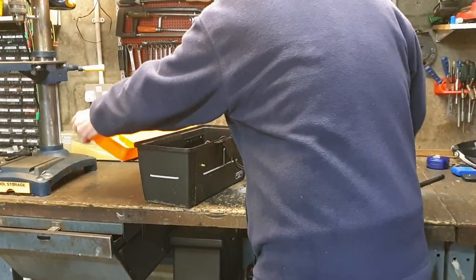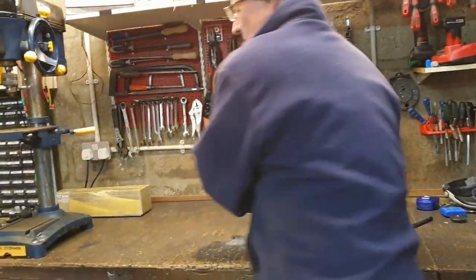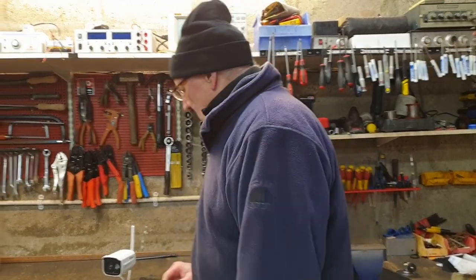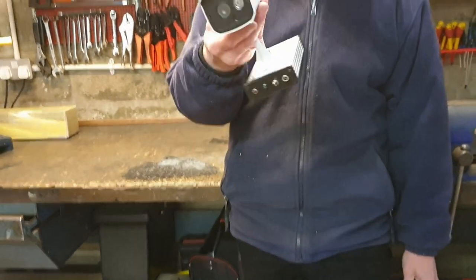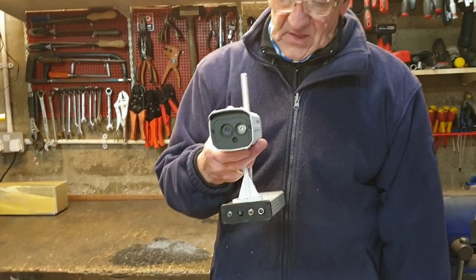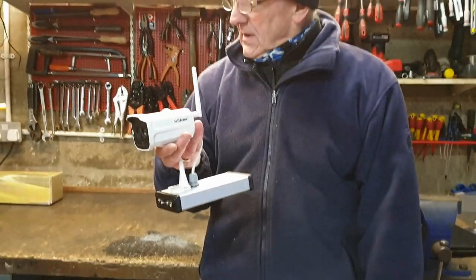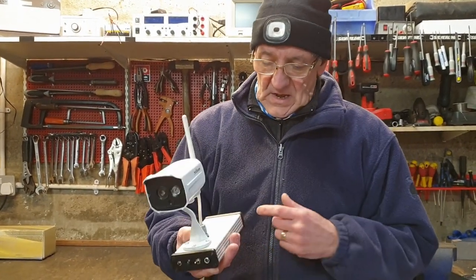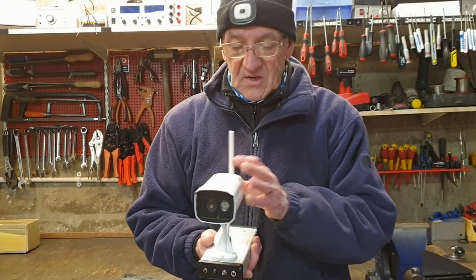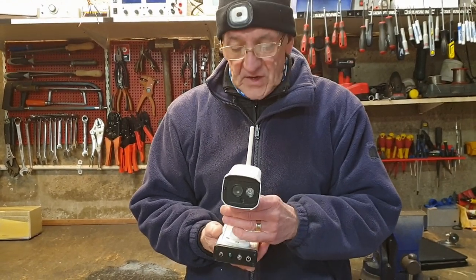So that was my first attempt. I really wanted to get rid of the Wi-Fi router and that big box and all the other stuff that came with it. So I started looking for cameras that had what they call AP hotspot — cameras which contained their own Wi-Fi hotspot — so that you could connect directly to them with a smartphone or tablet and not have to go through a router with no wiring. I found this little camera here which cost less than 30 quid, which I thought was unbelievable. It worked — it transmitted a signal. I could use the flat panel antenna and get a picture at 600 yards. I was able to put a small 12-volt lithium battery in this box. It's really very light and very easy, and getting it hooked up was a lot simpler as well. It looks almost small enough that you could have several for different ranges.